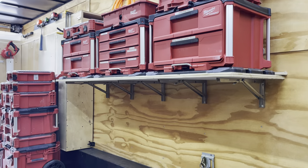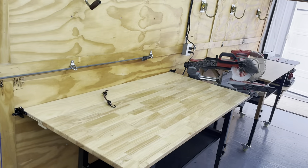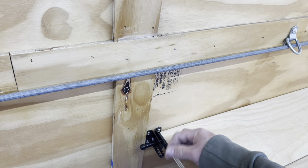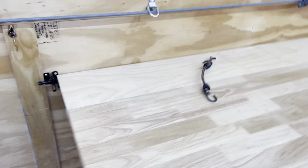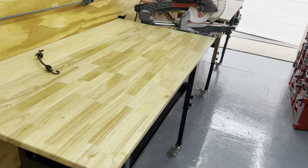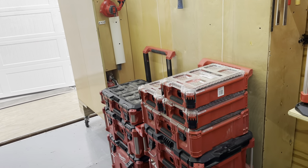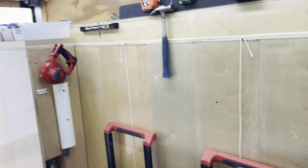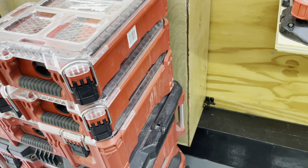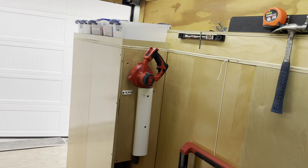The lighter side uses three countertop-style fold-down hinges; the heavy side uses five. On this side you can see gravity latches — pull into place and you hear it snap. The whole workbench rolls in and out of the trailer, pop those latches, and it takes me a minute to a minute and a half by myself. The big cabinet at the end is heavy — made of three-quarter plywood — but it's strong, will take the beating going down the road, and is held in place by four gravity latches. It only fits in one spot, so once it locks in, it's not moving.